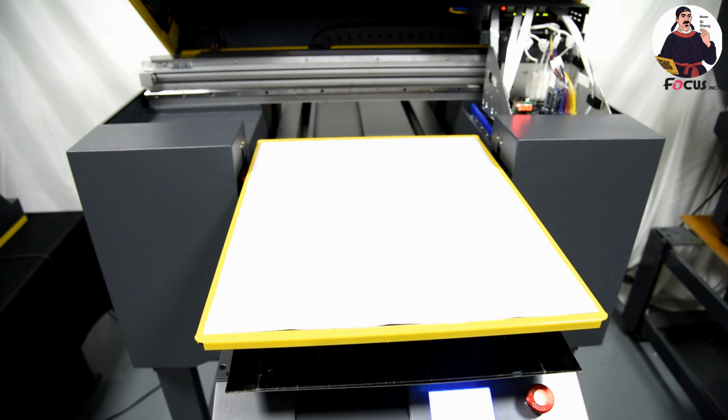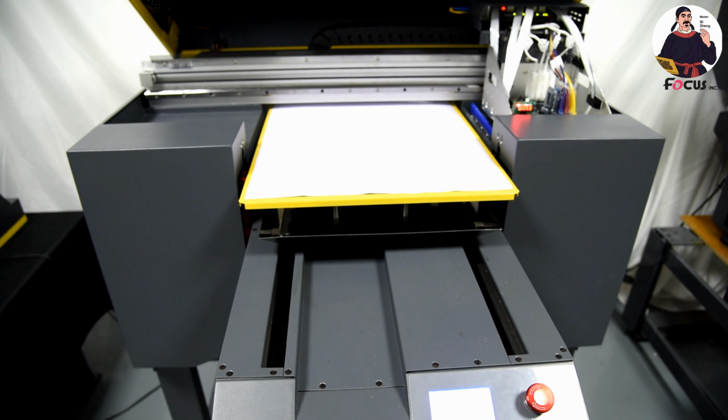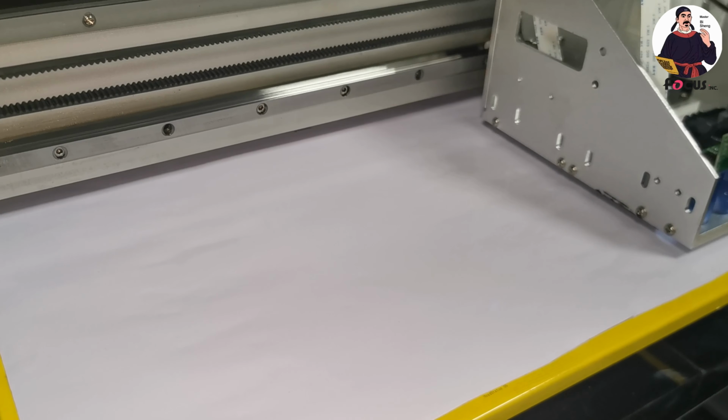Another check for the color print head. Load the paper, and we go to the software and choose head status. Okay, we can see all the KCMY, magenta, black, KCMY and KCMY are all coming out. So if we can get a good result like this, we can start to print.